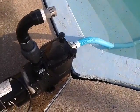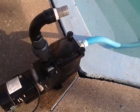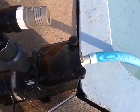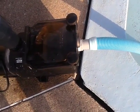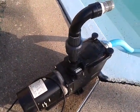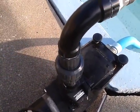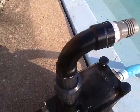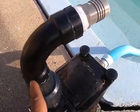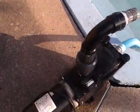I'm just using a small line at the suction. I understand some people always use a non-return valve at the suction end, but for convenience and because it is a little heavy, I didn't want the weight dangling from the end of the suction here. So I thought, why not install it at the discharge — at the outlet. That seems to be working well. Later I will turn it 90 degrees counter-clockwise so that the suction is from that side and the discharge goes out to the street.